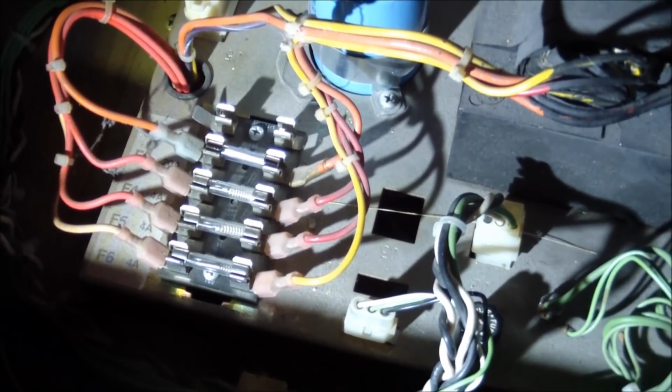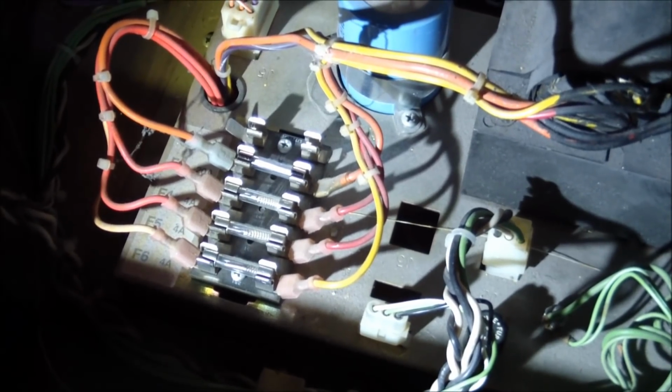Okay, here we are at the back. Remember that fuse I showed you earlier that I had replaced? It was kind of a dumb thing. It had that ceramic coating you couldn't see inside. So I just put a regular glass fuse in there so we can see it blow up when I turn it on, or not, but at least we'll know what's happening there. So we're all plugged in. The front safety interlock is in the service position. And here we go.